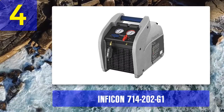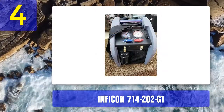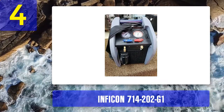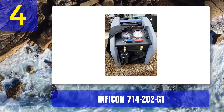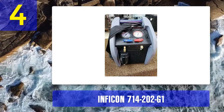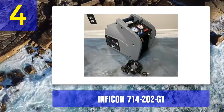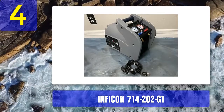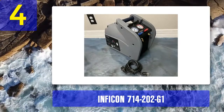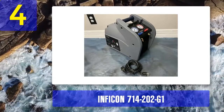The two-valve operation is easy for the average user, and the unit is equipped with a self-purge mechanism that doesn't require you to change hoses. It helps recover most common refrigerants like R-22 and R-410A, with recovery rates of about 0.6 pounds per minute for vapor and about 10 pounds per minute for liquids. Pros: sturdy, durable, well-constructed, excellent value for money. Cons: more expensive than most recovery units and quite heavy. Highlighted features: three-year warranty, dual compression cylinders, two valves, protected gauges for suction and pressure, tank filter, filter and dryer included, and an oversized fan for superior cooling.